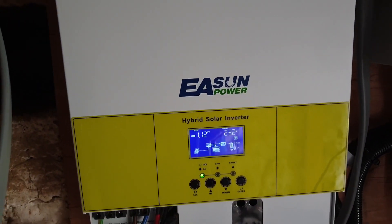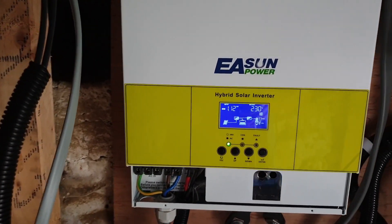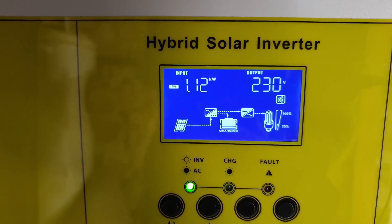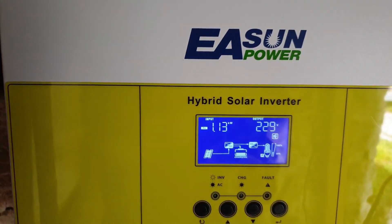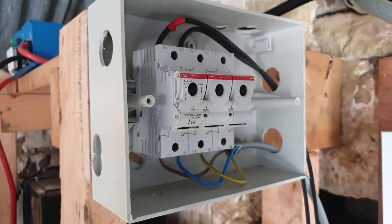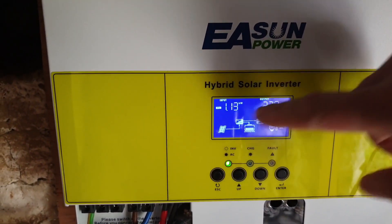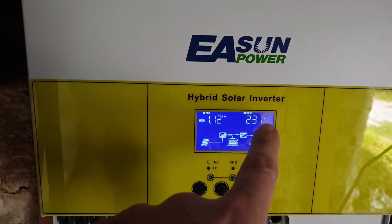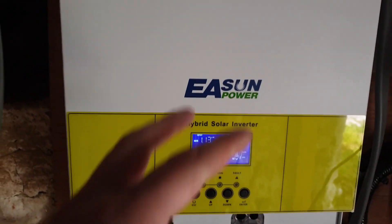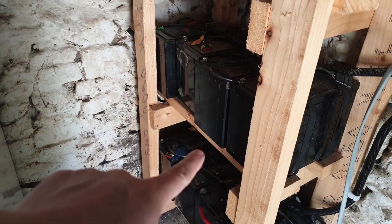Welcome to the power shed — here's our power system. On the wall we have a second-hand hybrid inverter rated supposedly to 5.5 kilowatts, and it pretty much is. We have a display here telling us that our PV input is about 1.13 kilowatts. That is a combination of the six panels up the field connected directly to it through a solar-rated disconnect, plus the power being drawn from the grid tie inverter — which is doing its best to pump up the grid that this inverter is connected to, and the inverter takes that and shoves it back into the battery bank.